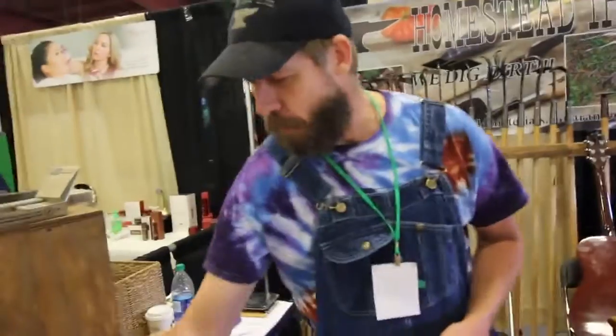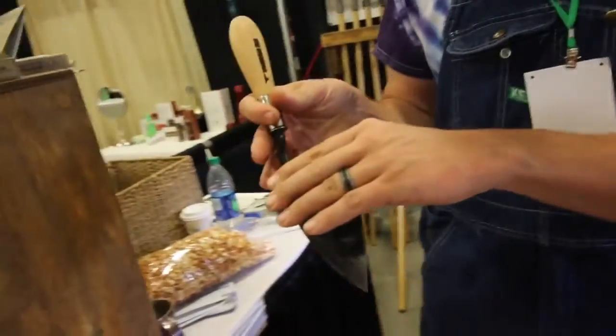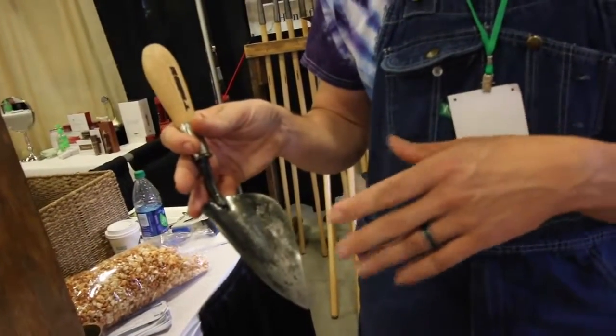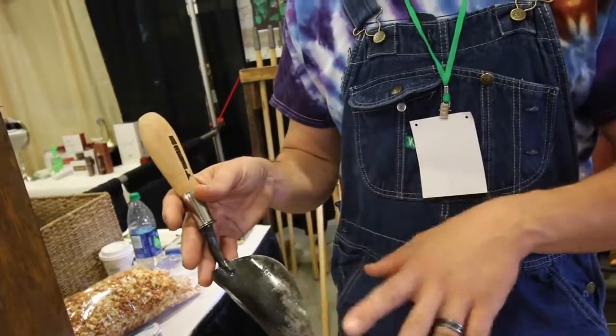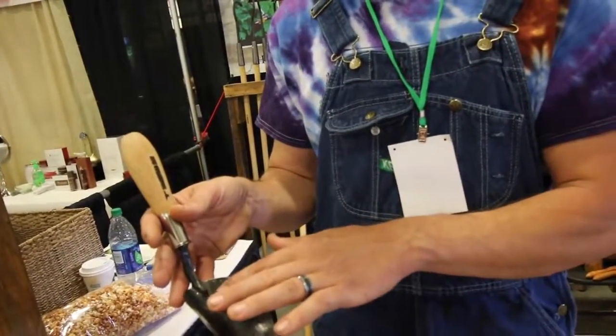So what's your process of making all these nice fine tools? Well, it varies a little bit from tool to tool, but the first step is the forging. We start forging all the shanks first. The blades, I cut these blades out in a plasma machine — we buy this in 4x8 sheets. Depending on the tool and what we're doing, we'll do all the forging, get ready to weld, and then there's a clean-up step to get this down to pristine metal for the weld.